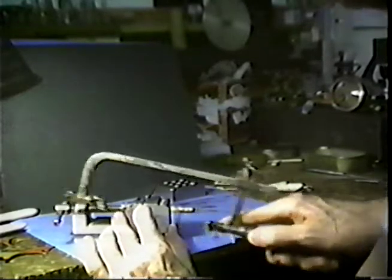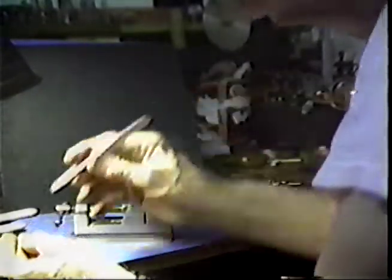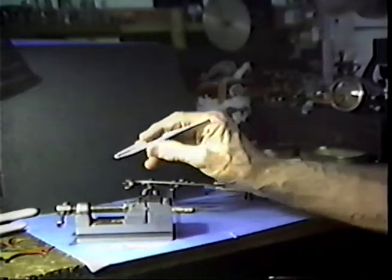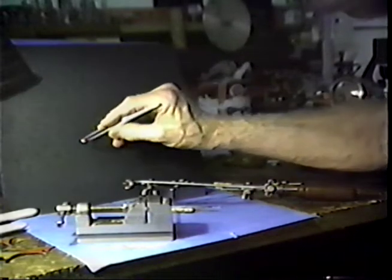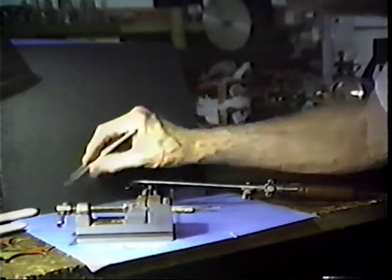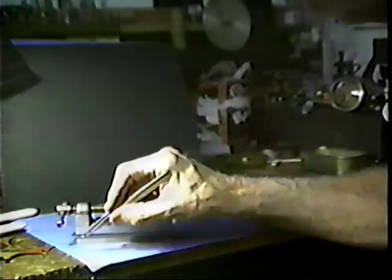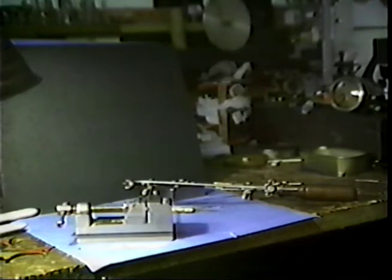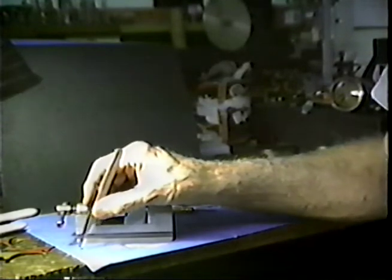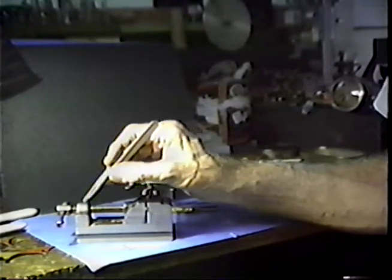Let's see if we can catch this one. Here we are. Let's look at the piece that we've sawed off. In normal practice, this is not the way that you would cut a rod off. The first ground rule in making small parts is: make the part with a handle on it, and let the last operation cut the handle from the part.